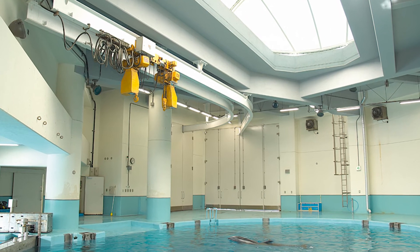Are there any places where these hoists aren't a good fit? For salt water environments, we do well — we sell into ship manufacturing — and the IP55 rating keeps out salt water, though it can still limit hoist life somewhat, but we'll still outperform the competition. The one area where we don't yet have a fit, and something I'd love to see, is explosion-proof. We do not currently have a three-phase electric chain hoist that is explosion-proof.